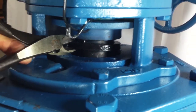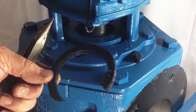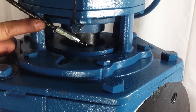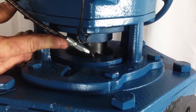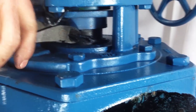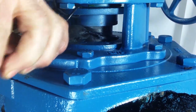Use the side cutter to slice the ring. The packing removal tool can be used to extract each of the softer, more flexible packing rings that follow. The side cutter will easily snip the rings, which can then be lifted out with the needle nose pliers.